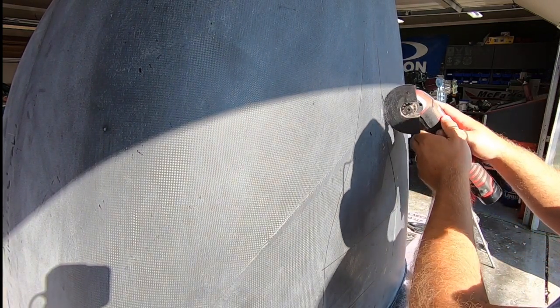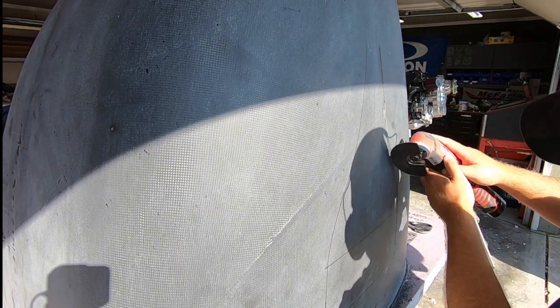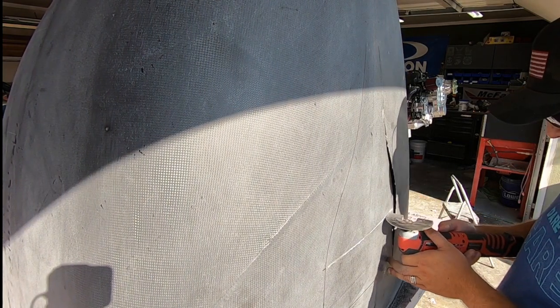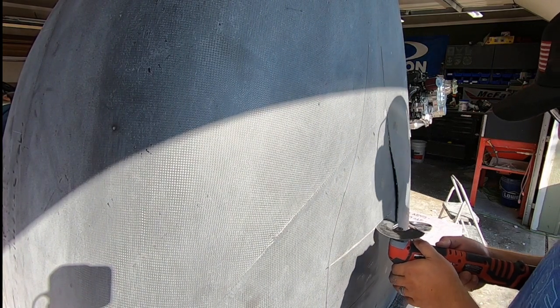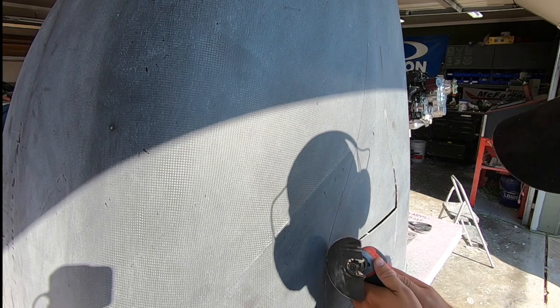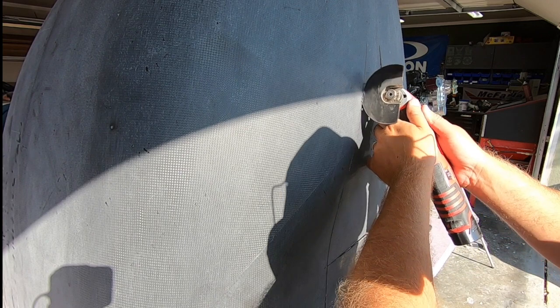First off, after shutdown, there's a good amount of heat in this system, and that needs to go someplace. And secondly, the vent lives in the hot side or the post-cooler section of the cowl. This area needs to be of lower pressure in order to suck the air through the coolers as much as possible. I will have the traditional exit in the bottom rear section, similar to other aircraft, that will also help with this lower pressure, and you'll see all that in the coming weeks.